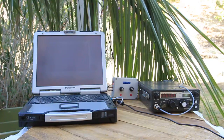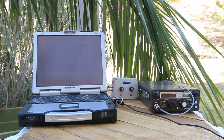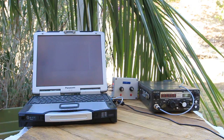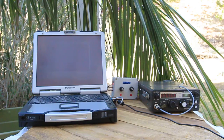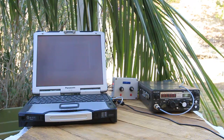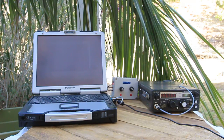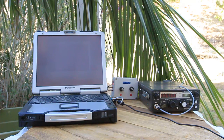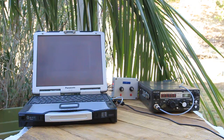So how EchoLink works, if you haven't heard of it, is it actually connects ham radio operators across the internet. Now that's not so interesting for ham radio operators, but the nice thing it does do is it can connect two RF links — think of it as being able to extend two repeaters or two radios across a very large distance. I put this together for the Boy Scout Jamboree on the Air just to guarantee that we get some DX contacts.